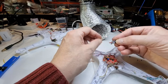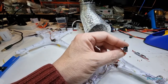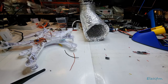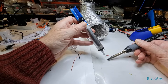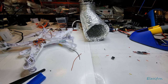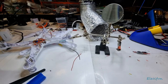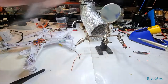This one might need just a tiny bit more stripping. Down the bottom it's got a bit of heat shrink around it to protect the board. Let's pop these onto here. We'll tin the ends — just get yourself a couple of pairs of snips: one for the rugged jobs, and one for when you want nice, clean cuts.